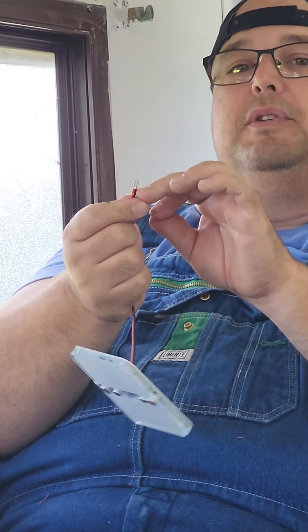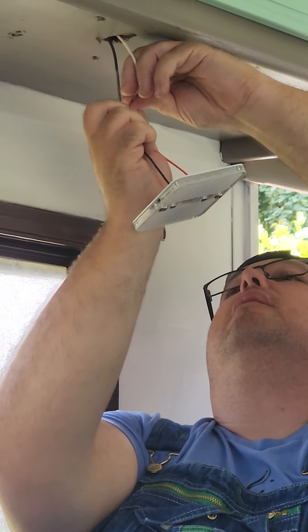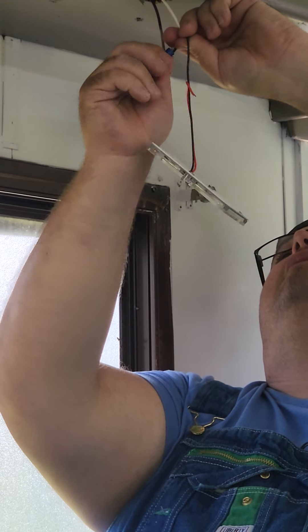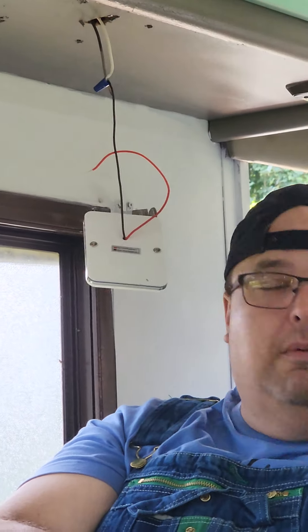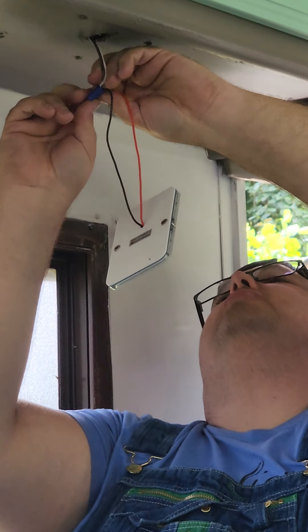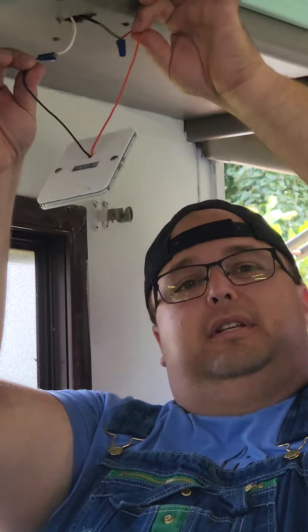What I'm going to do is undo my wires. If you have a soldering iron, go ahead and use it, but I'm not going to do that because if I ever have to take these off later, I have the opportunity to remove them. So I'm going to take my wire nut along with my wires, give them a couple twists, then put the wire nut on there until it won't turn — kind of twist both wires together. I give them a little twist before I put the nut on — you don't have to, but it makes it easier.